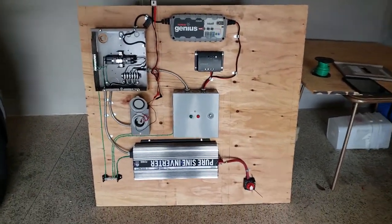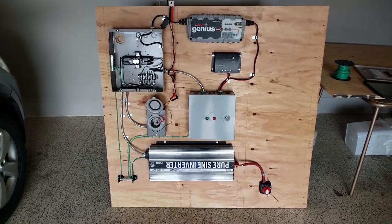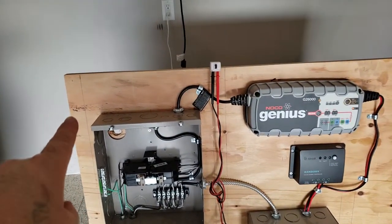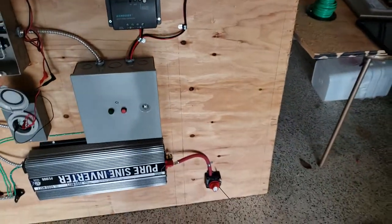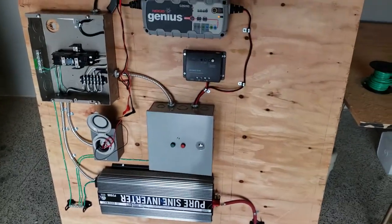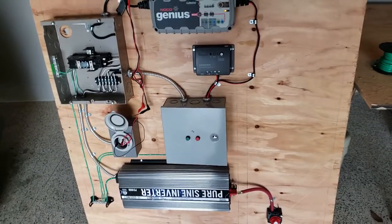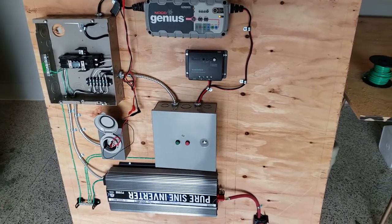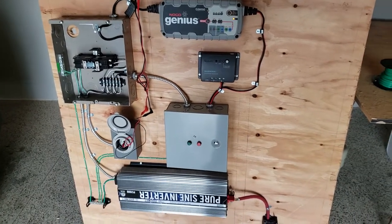The next step is to take this entire board, drive it up to her property, and install it. I've already marked out the studs — her shed is 16 inches on center, so I've got four studs it will mount to. I also need to make the battery terminal connections for the bank of batteries and install the entire solar system. I plan on using Unistrut for the framework. I need to get the panels high enough that snow won't affect them, since she does get heavy snowfall, but low enough that she can reach them with a broom to sweep off the snow.